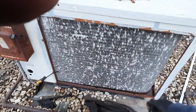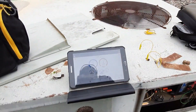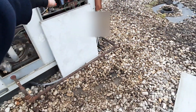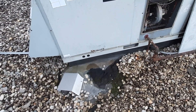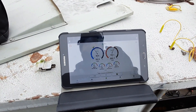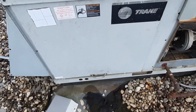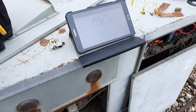We've obviously got some hail damage. I'm getting heat out of that condenser right now. I'm running 200 PSI on my head pressure, with 102-degree saturation temperature on the condenser — and it is literally 45 degrees outside right now. That's telling me this thing is probably overcharged because that's a bit high. I'd like to see this thing when it's 80 degrees out. They may have us come back and look at it when it warms up, especially if there's an issue. But at this point we're just trying to get a little more life out of this thing.